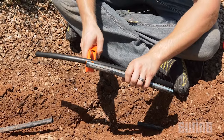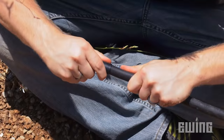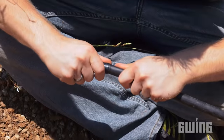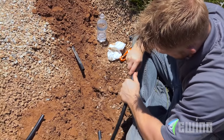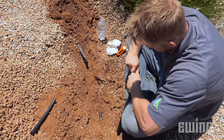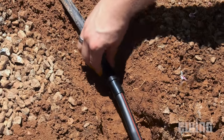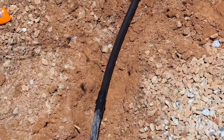Use the section you cut out as a guide to cut the same length of tubing from the new roll. Now attach an insert or compression coupling to either end of the new length of tubing — they can be a little tough to get on, so apply a little water to the tubing to make the connection easier. Finally, making sure both ends of the existing tubing are clean, connect the new section of tubing to complete the repair.